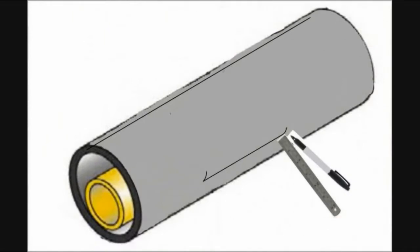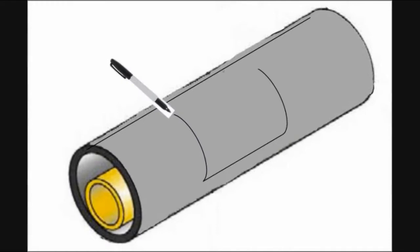Now that the first longitudinal cut is made, mark out the remaining window cut. Insert a ruler into the end of each completed cut and mark each edge. Then draw two straight circumferential lines to the proposed second longitudinal cut. A length of tape or a welder's pipe wraparound ruler will make it easier to draw a straight circumferential line. Sketch the longitudinal cut line simply by connecting the two circumferential lines. This will ensure each circumferential cut will travel through each longitudinal cut.